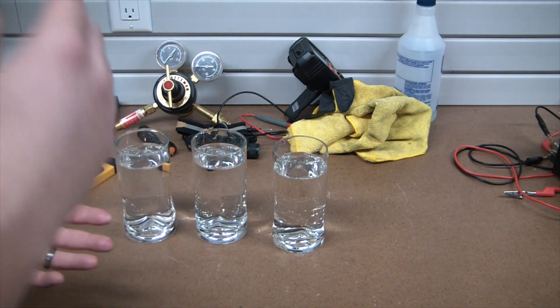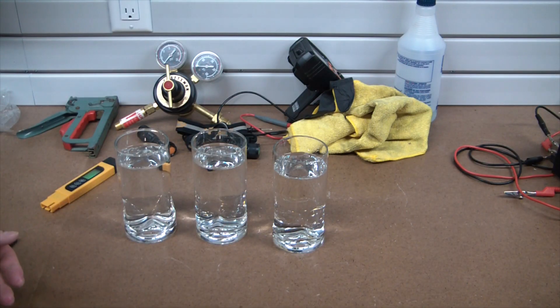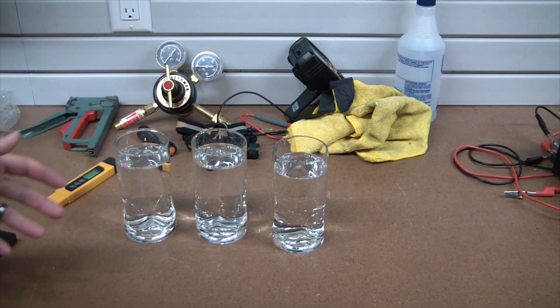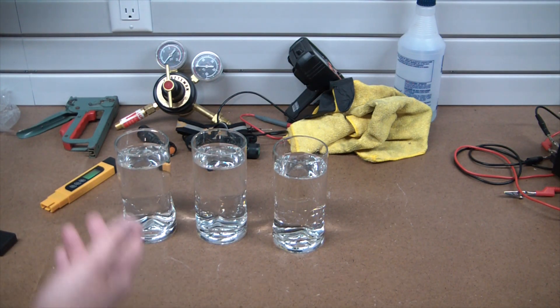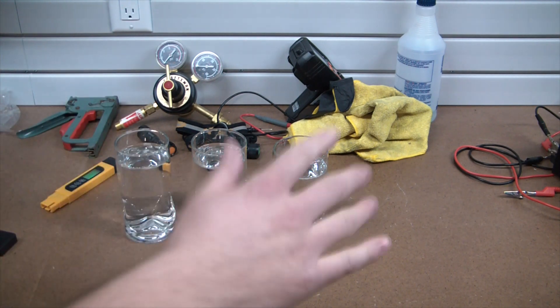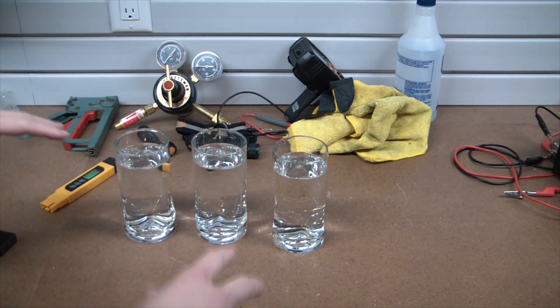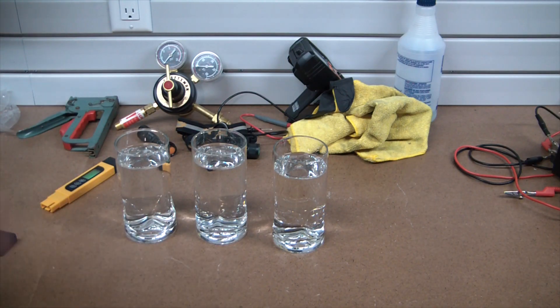The lab branch is going to be deionized — it's going to run through an inline deionization filter with a nuclear grade resin. That's going to take the water down to like 10 megaohms or something, but it's going to be ultra-pure, zero parts per million, zero TDS. You can literally spray it on your car, let the water evaporate, and you wouldn't get water spots because there's no minerals dissolved in the water at all. That's the goal here.